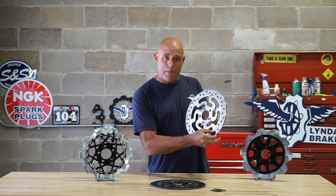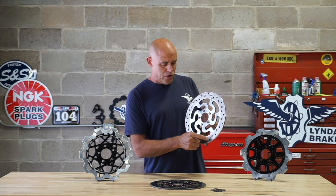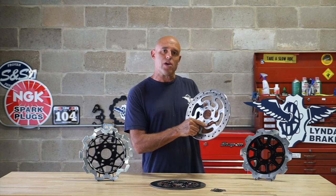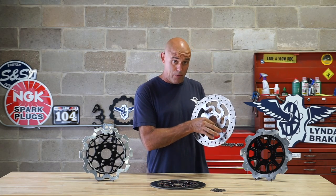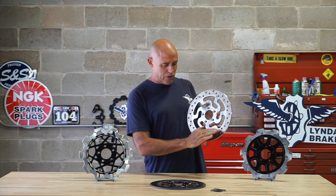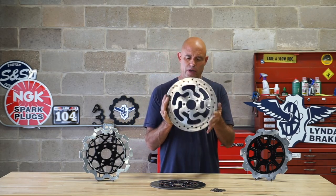When you have a high amount of thermal expansion here and a low amount here, you start to cause internal stresses in the material. So the molecules are moving around a lot here, they're not moving around so much here, and you start to get internal pressures into the material because the molecules are moving at different rates.